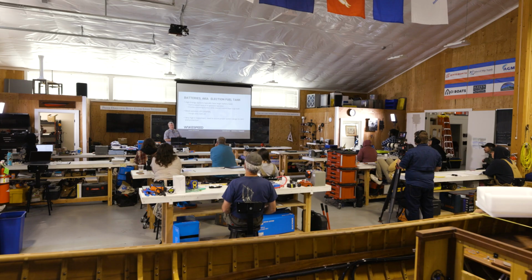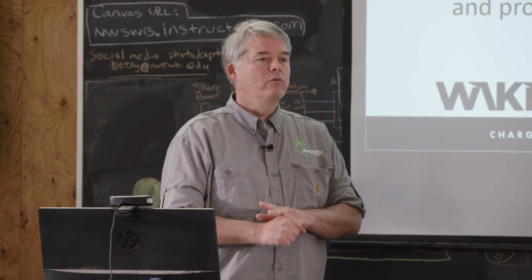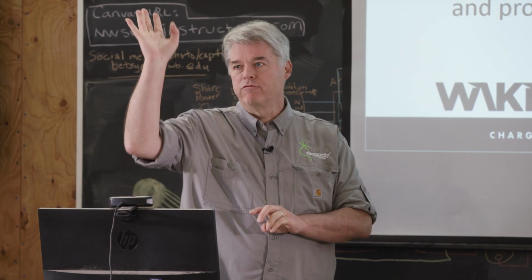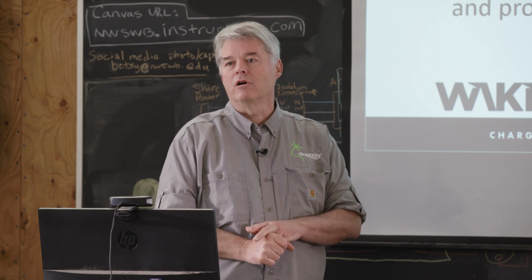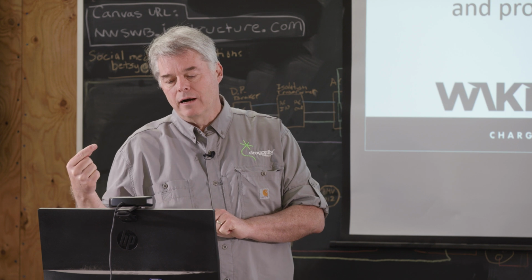So the batteries, you're sizing them based on how long people want to be able to run without a charging source providing recharging. And that can be the engine, which we're really focusing on here, increasingly solar panels. Solar panels are really, I have another slide on this, really relevant in the marine world. We actually have 480 watts on Viking Star, and we'll talk more about that in a bit.